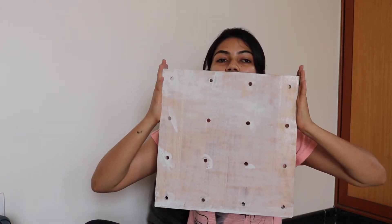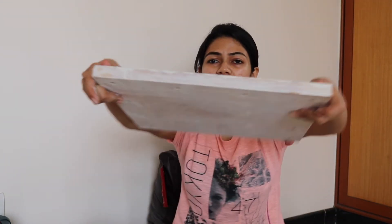It is the next day and what I have now is this pegboard. One of the mistakes that I made here is that I should have just applied transparent varnish, but I applied a white colored primer, which is why it's turned out like this. So what I'm going to do is sand it down first to remove the excess primer, and then I'm going to apply either white spray paint or acrylic paint on top of it because I think I'll just make the whole pegboard white — it can't stay the wooden color that I wanted.